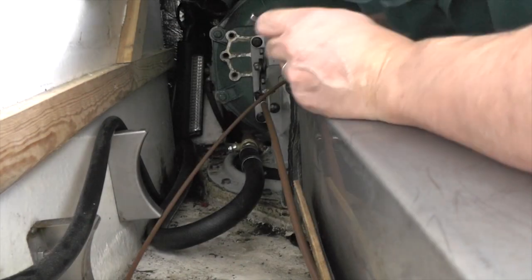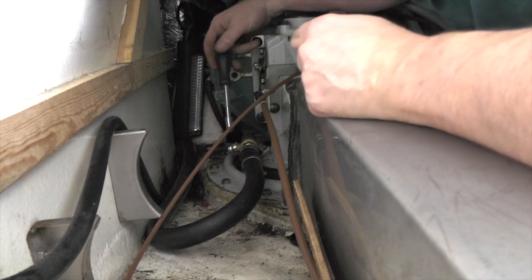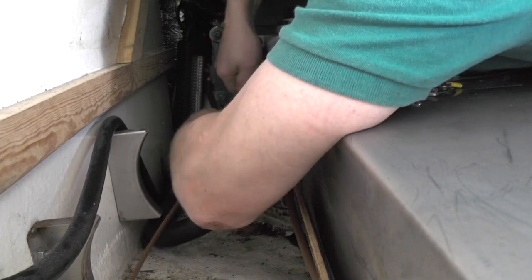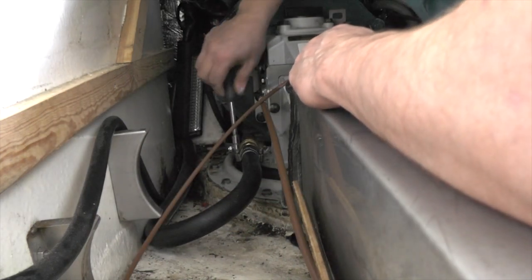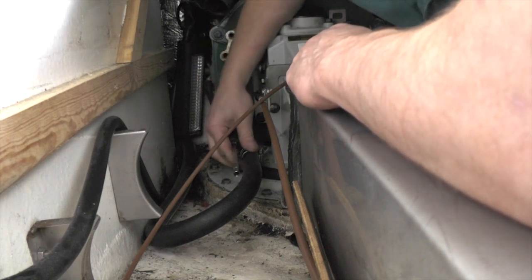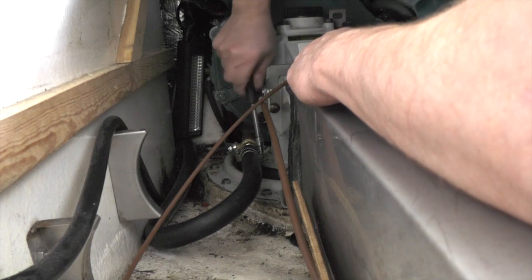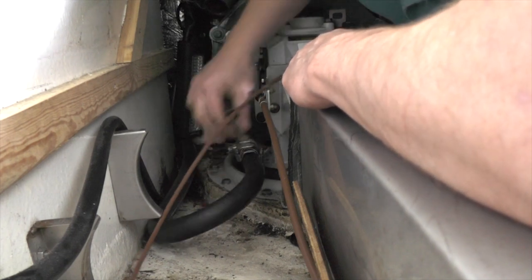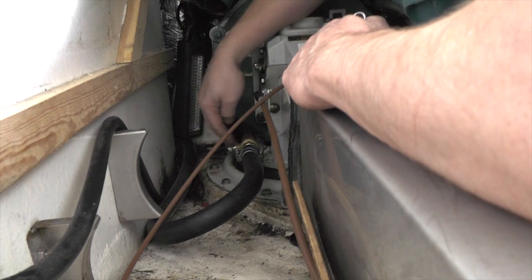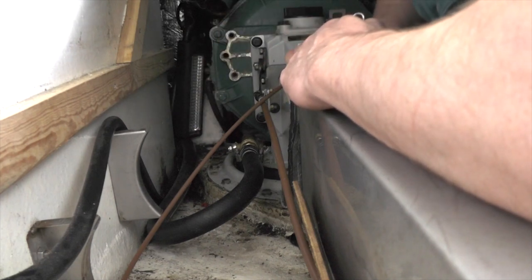The nut on that handle is 11mm and the heads on these hose clamps are 7mm. There must be a right answer to how tight to do hose clamps: over-tighten and you risk splitting the hose; not tight enough and you risk a leak. Of course, that is one of the reasons why you have two hose clamps. Here we go — one seacock with a hose on it. Fantastic, that's it!